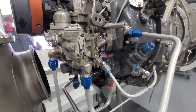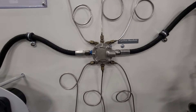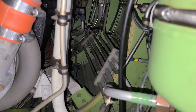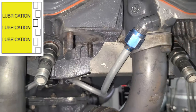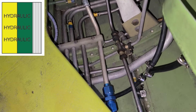In this video we will address the overviews and the manufacturing processes of various types of fittings for aircraft rigid tubing. Aircraft fluid lines are usually made of metal tubing or flexible hose. Metal tubing, also called rigid fluid lines, is used in stationary applications and where long, relatively straight runs are possible. They are widely used in aircraft for fuel, oil, fire protection, oxygen, instrument, and hydraulic lines and are identified by color codes.